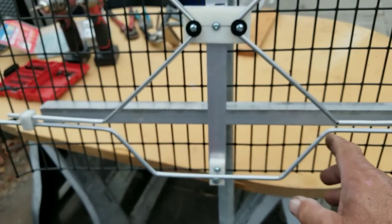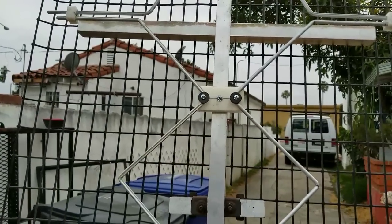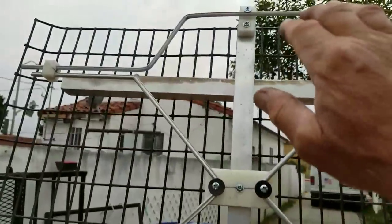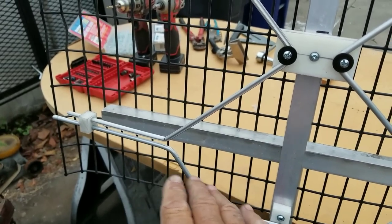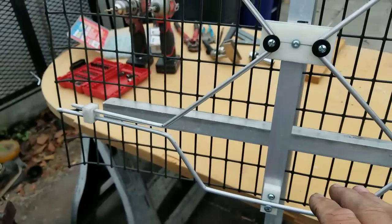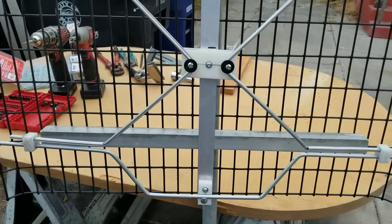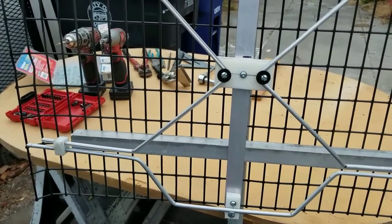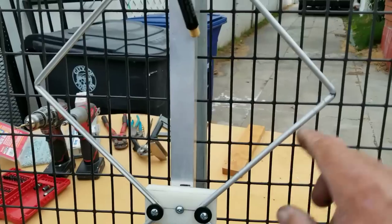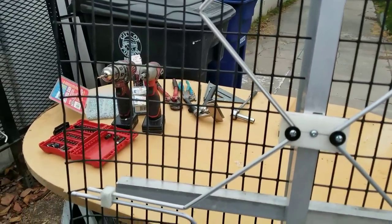Let me show you a little bit about this. These two zigzag wires going up — that is the VHF part of the antenna. And this part, they call it the hat; they have one at the top and one at the bottom, and that is in no way connected to those other two — it's completely separate. But for some reason, adding that allows you to pick up UHF channels also, so if you have a VHF channel that's right on the border of a UHF, that will allow it to come in crystal clear. All of these distances — this is seven inches here, seven inches here — and these are 90-degree angles. All of that stuff is important; I can't stress that enough.